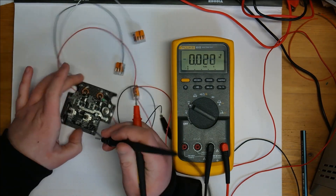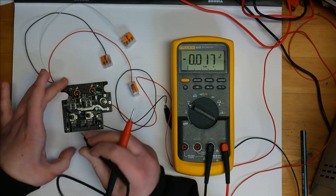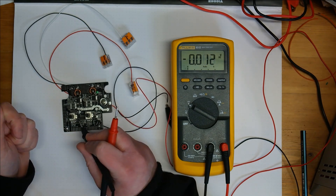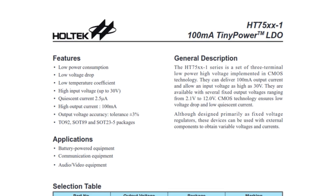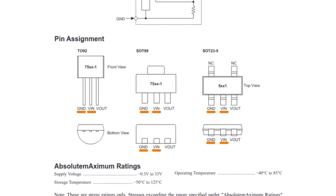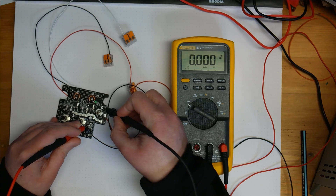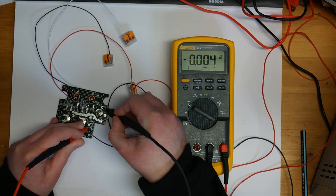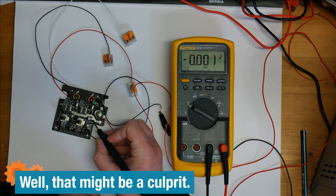So it's either the microcontroller or the power supply to it. The easiest thing to check is the power, because that 5 volts will be going to the microcontroller. I'm going to look at the datasheet for the regulator. It's a 10 milliamp tiny power LDO - ground on pin 1, V-in on pin 2, V-out on pin 3. Ground is ground. V-in I've got the 12 volts I'm expecting, and V-out has nothing. That's my culprit - I'm thinking it's likely to be that chip. Before I order the part I'm going to check there's nothing further that could be the culprit, so I'm going to remove it.